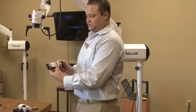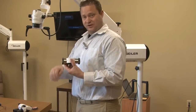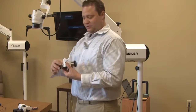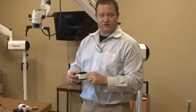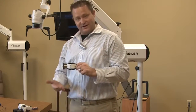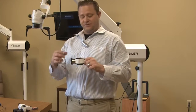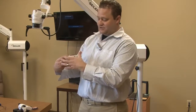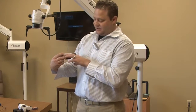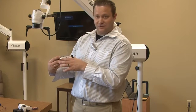What that means is we have two individual prisms. 100% of the light is going to be going down through the optical path. Remember, it's all coaxial illumination, so it's completely shadow free. After light hits the specimen, it's going to bounce back up into the beam splitter. Depending on which path you have the video or digital on, that's going to be the amount of light reflected into the right side or left side of the port.